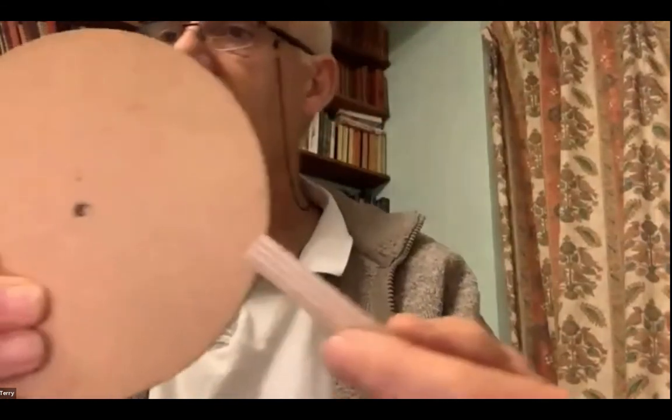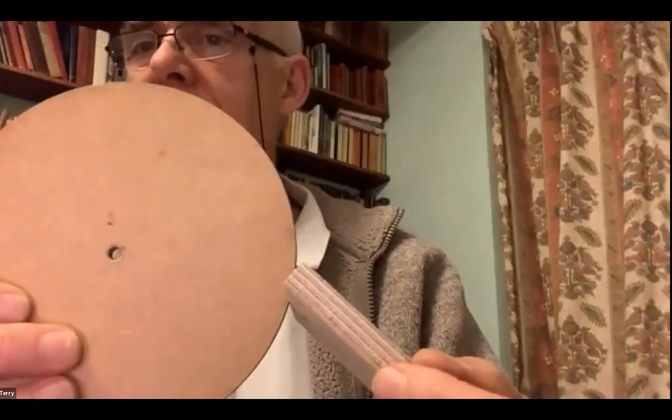Okay, now, jig grinding. I'm going back to grinders here. If you're sharpening a spindle roughing gouge, a skew chisel, or a scraper, then the best way to do that is on a platform. If that represents the grind wheel and this represents your platform, all you've got to do is lay the tool on the platform at the proper angle and put it on the wheel and slide it backwards and forwards for the flat tools.